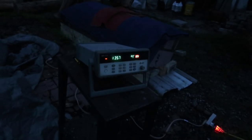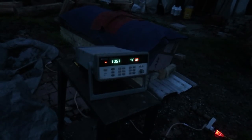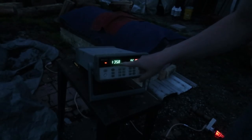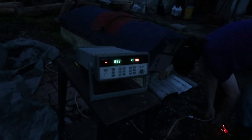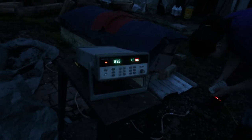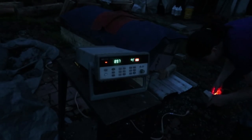Well guys, I got some insecticide and sprayed all the logs, moved them away from the workshop, and unfortunately it looks like that 800 watt heating element isn't quite strong enough. So this is a thermocouple that I added on the outside of the log, 135 degrees. This is a thermocouple on the inside, it's 90 degrees, before it was 104. So it's obvious that it needs more insulation. And it has used 4.41 kilowatt hours. So it's not too bad. Now hopefully it actually killed something.